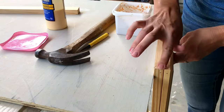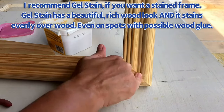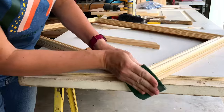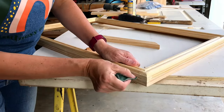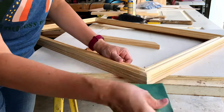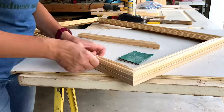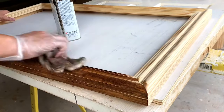I use a nail set to set any brad nails that didn't go in all the way. A couple of hours later, after the wood glue has completely dried, I carefully avoid separating those corners. Then I use wood filler — since I'm painting this frame, I don't need to worry about a perfect stain. After letting the wood filler dry, I used 100-grit sandpaper on the corners where the molding pieces meet at the 45, then moved on to 150-grit. If you're staining, you may need to sand to a higher grit.